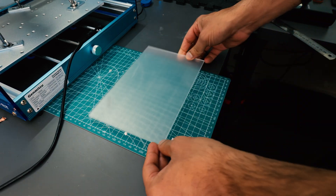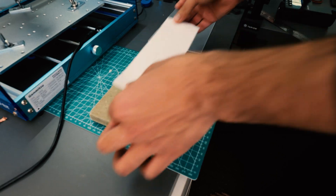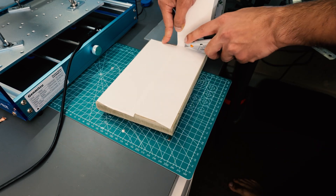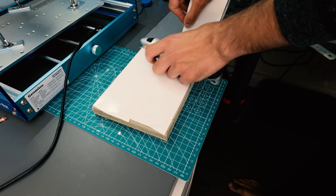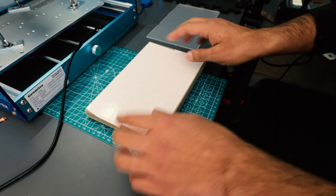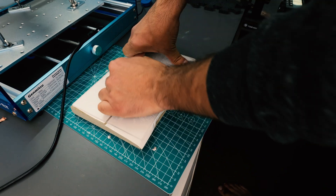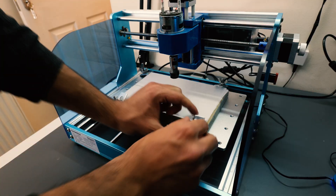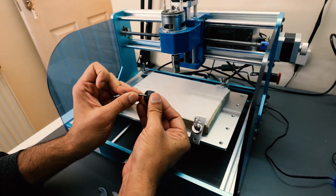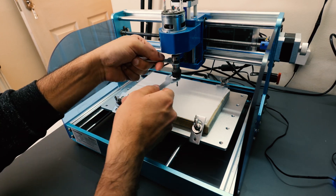To start off with, I cut the acrylic sheet down to the approximate size I would need. I used a spare piece of MDF to fix the acrylic onto — the purpose of the MDF is so that once the CNC bit comes through the acrylic, rather than damaging the actual machine, it has some spare MDF to cut into, which I can always replace. I also used some double sticky tape to fix the acrylic onto the MDF so that once it's been cut, it doesn't move because of the pressure of the CNC bit. I used the supplied clamp to fix the MDF and acrylic onto the bed. The last thing was to put the right CNC bit in and then we're off and away.